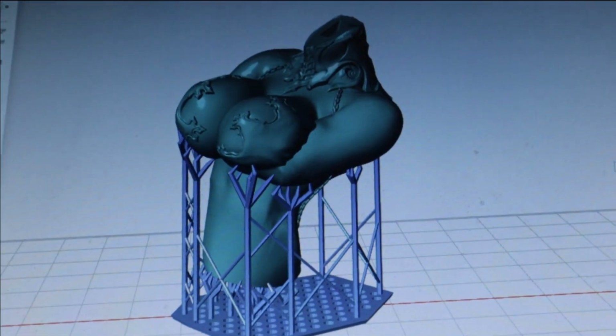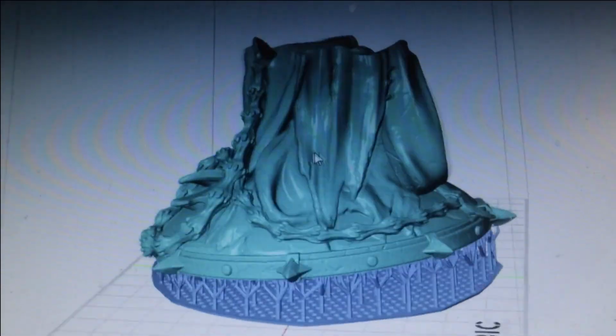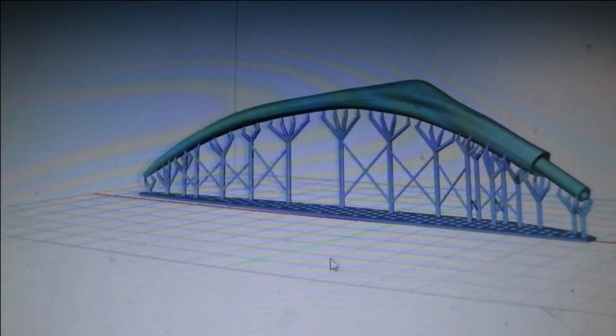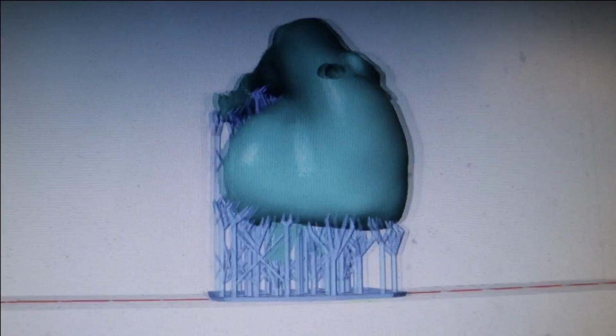The components were scaled, shelled with a 2mm inner wall, and a few holes cut out where the glue points will be hidden to drain all resin and not to explode, then supported in an orientation where the nubs will be less likely to be seen or not obstructing detail.